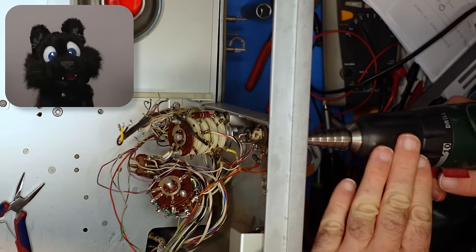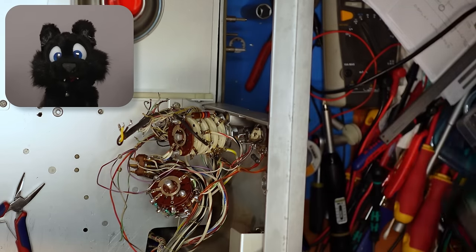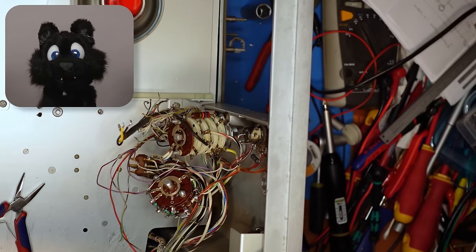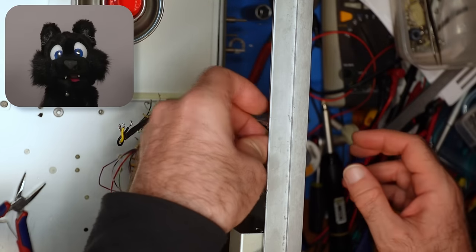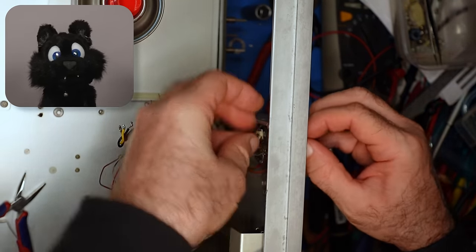There's a camera power outlet on the front that provides 15V DC for a camera to take pictures. It originally had a weird 3-pin connector, but that has been replaced with a 3.5mm headphone jack on my unit. I don't really like those for power, so I replace it with a normal barrel jack instead.